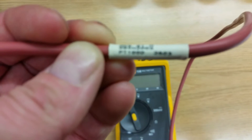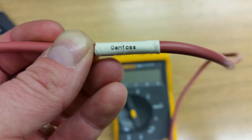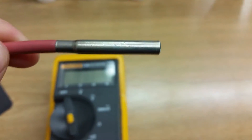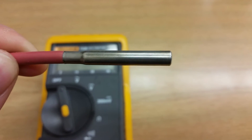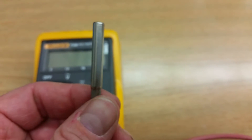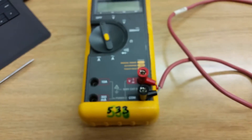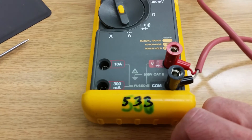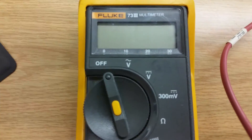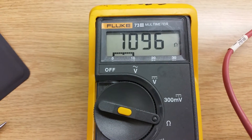We said we were using a PT-1000 — the manufacturer is Danfoss. Inside there's a stainless steel housing, inside of that is a ceramic piece, and then a piece of platinum wire wound around the ceramic. As the temperature heats up the stainless steel, the heat is transferred to the platinum. This is a two-wire RTD that we've reconfigured with jumpers so we can place them right into the meter. We're going to change it over to resistance setting and let it stabilize.